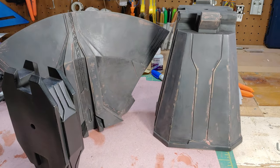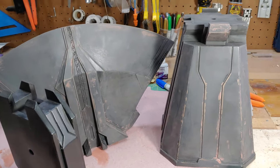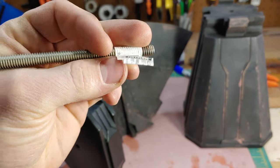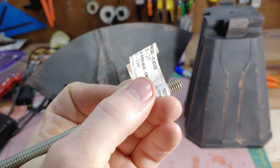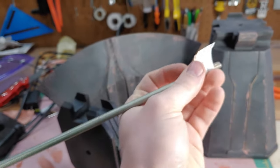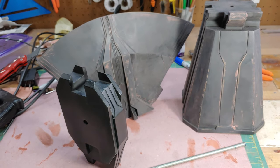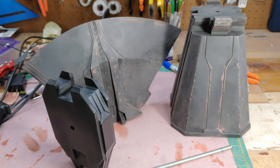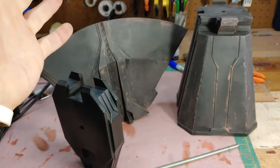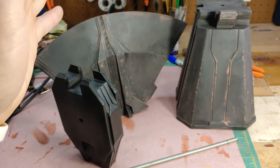Now you have your parts to the point where they're almost done and they just need one more layer of primer. We're going to take our threaded rod — the correct size is 5/16, 18 threads per inch — it's a two-foot bar but we're using less than a foot. We'll cut it with a hacksaw to the right size, then use super glue to glue all these pieces together, because I found super glue makes a stronger bond than epoxy when I tested it a couple years ago.